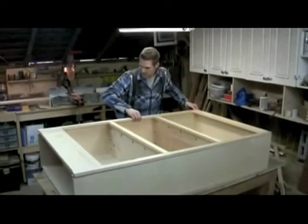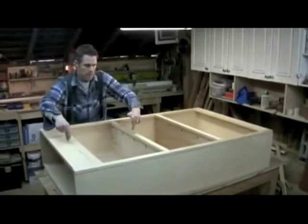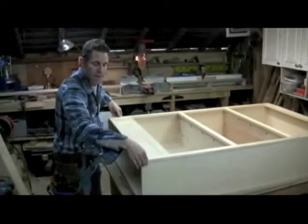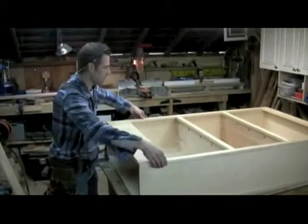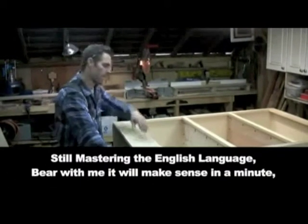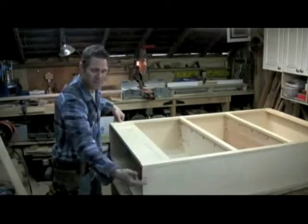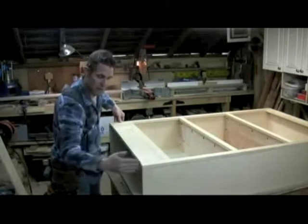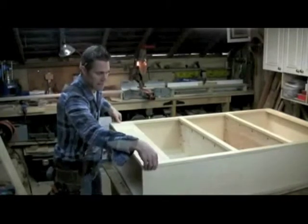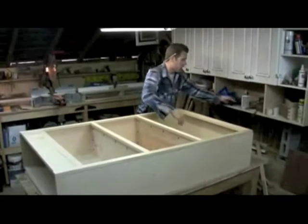We've got the glue on there and plopped this on top. Now the one thing I made very important when building this is that when you make these length rails, you want them a little bit longer so you get a little bit of an overhang. That way I can come back and trim it with a laminate trimmer or a flush trim bit. It is actually proud of this piece of wood there, so we can come back and trim it flush. If I try to make it flush exactly throughout the whole thing, it's just going to be more difficult. Make it a little bit proud all the way through and then screw it all together.